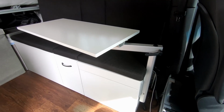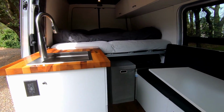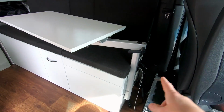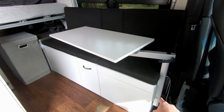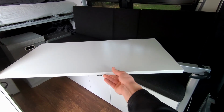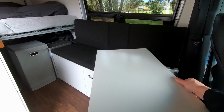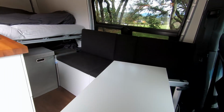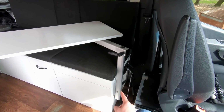And so that brings us to a very interesting topic. Where the heck is the best place to mount your table, and why did I choose to mount mine right there? Well, first off, when choosing where to mount your Lagun table, you need to take into consideration that it does indeed swivel, sometimes in your cabinet like I just showed. It could potentially have a lot of area to swivel, or it could potentially not. And that really depends on where you mount the bracket.